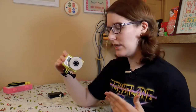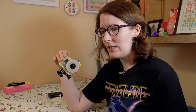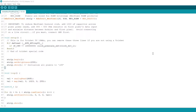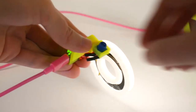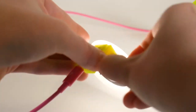They sell them in different temperatures, so I got one that is kind of a room temperature, more of like a natural white, not like a blinding one. I decided that I wanted to just use the white light coming from the NeoPixel ring, and in the code I have a potentiometer wired up so that the potentiometer values are controlling the amount of white light showing through.